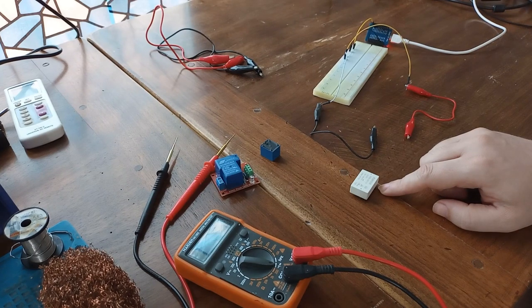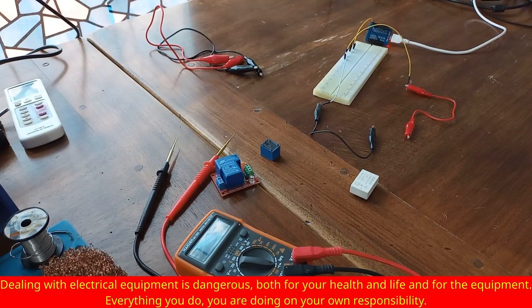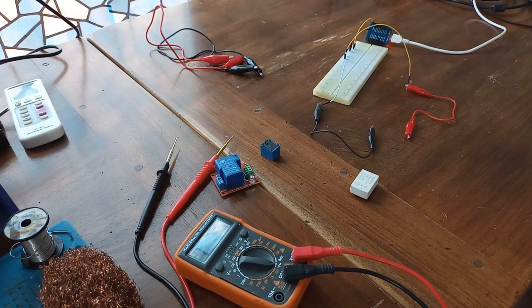If the control voltage is bigger, that means that if you want to use it with your microcontroller, you are probably going to need some secondary power supply that you would have to control with transistors, for example. Of course, the second thing that is important for you is what kind of load you are going to have. And there are many choices on that part.